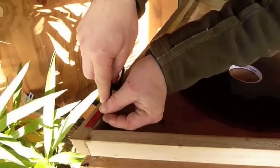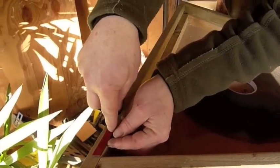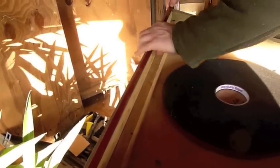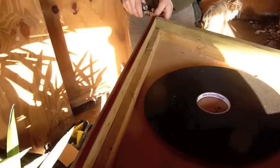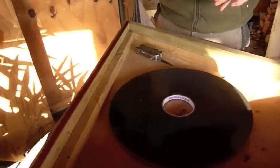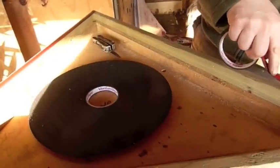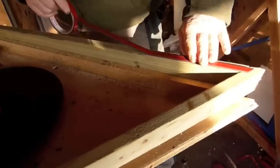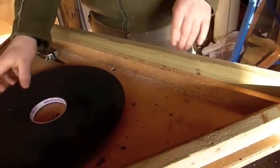Now we're going to have a look at covering a GD18 frame with a solid 2mm polycarbonate sheet. We start with a glazing tape which is stuck to the timber frame. It needs to be about 10mm wide and 3mm thick — it's a foam-based glazing tape. You should be able to find this in most glazing supply stockists.